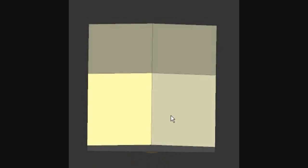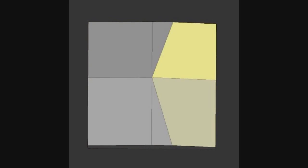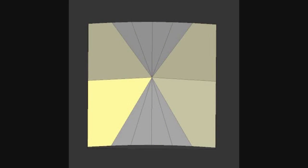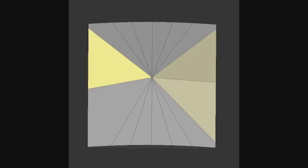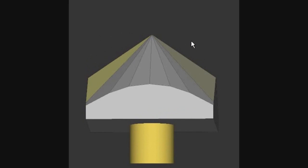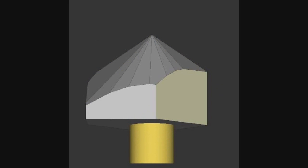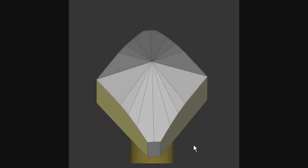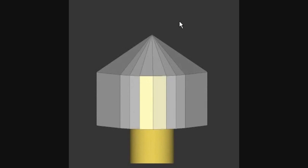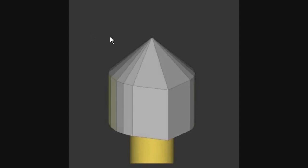So once the first four facets have been cut to a center point, there's a series of other facets also cut on the pavilion. Each one of these facets needs to be cut to a true center point too. This has to be done perfectly. If not, then when you're cutting the crown, everything will be out of alignment. So the next step will be to cut the girdle facets to depth, and these will need to be cut accurately also. So this gives you the basic outline of the girdle and the pavilion facets.